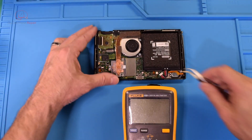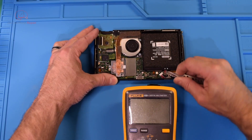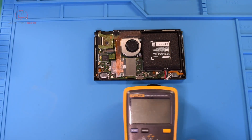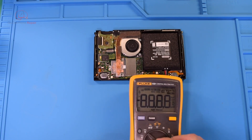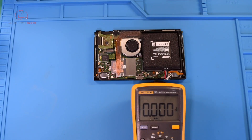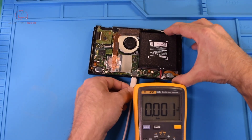What I generally do is disconnect the battery from the terminal, because we want to know what is being delivered right where the device is charging. I'll put my multimeter in DC voltage mode, connect the power, and then we can start to eliminate different things.